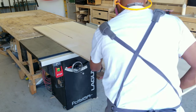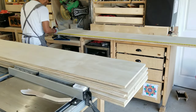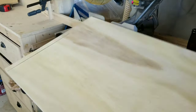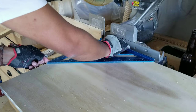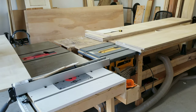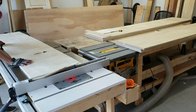If you notice, I flipped over the plywood sheet because I like to reference off of the factory edge against my table saw fence. And of course, always checking for square. Now I wanted to include this shot because this is the wrong way of cutting down a long piece of board that is longer than the width of your table saw.